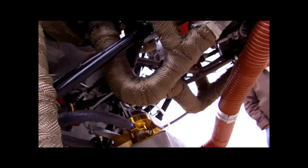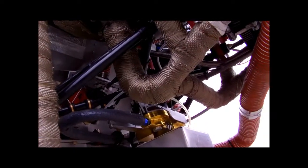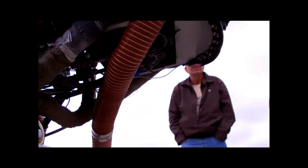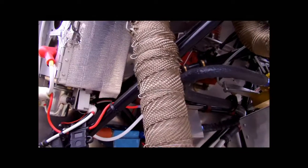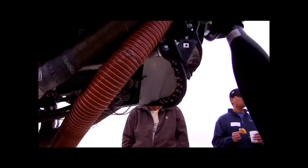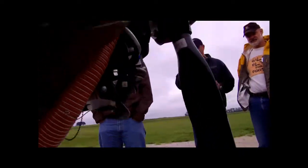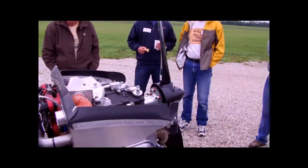After installation, there were some items that had to be addressed, and the main one was bolts. I don't know whether the turbo's vibration is such that it doesn't let bolts stay tight, but it's something that people need to watch out for for the first 10 or 15 hours. I've got about 52, 53 hours on it now with the turbo, and all the bolts seem to have seasoned and gotten themselves settled in. It's not an issue anymore.